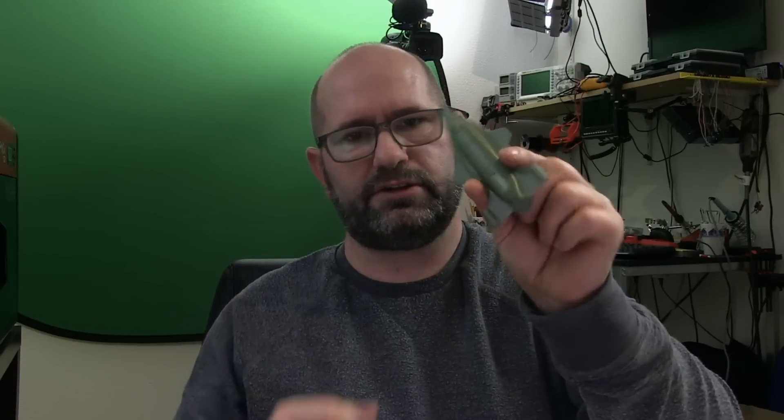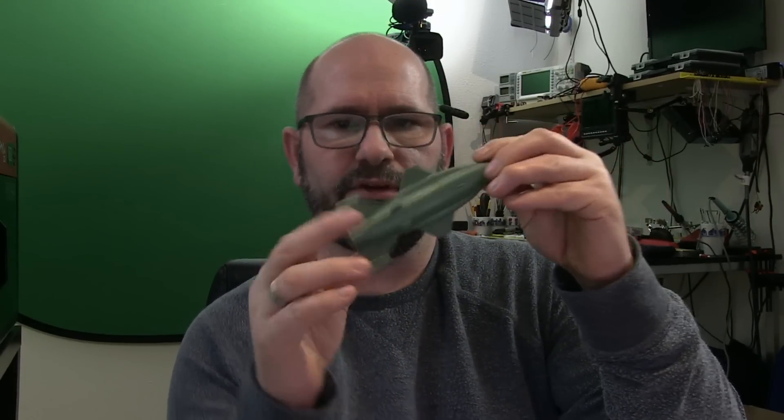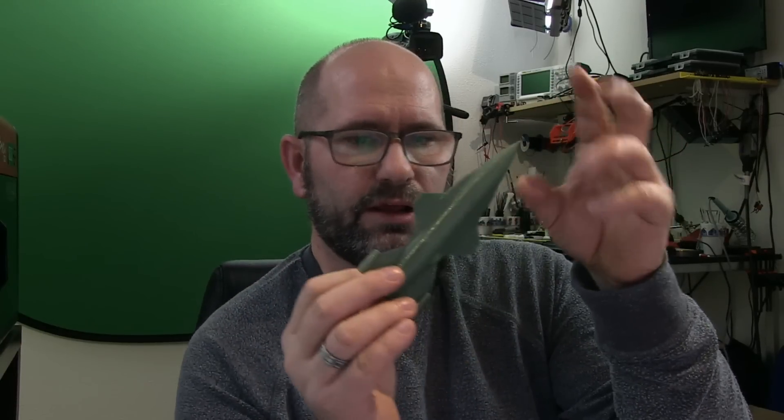Then I wanted to make a first print to see how strong PETG was, and I printed something in spiral vase mode. The spiral vase mode is a mode in which the printer prints in a continuous loop — it won't stop to make a new layer. All the layers are laid down by just lowering the bed in a continuous motion. I printed this airplane I found on Thingiverse — link in the description — and it came out great. It's a little bit translucent, so I can see right through it, and it's very very nice.